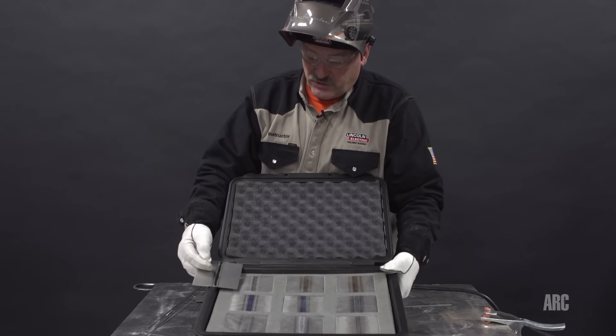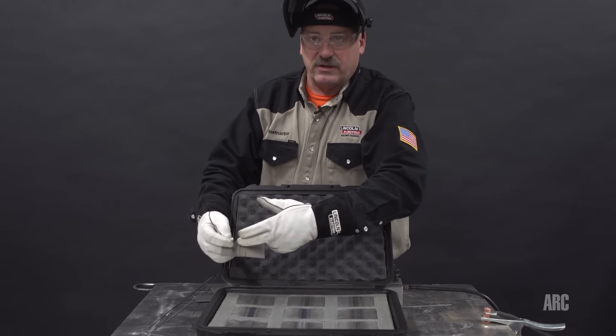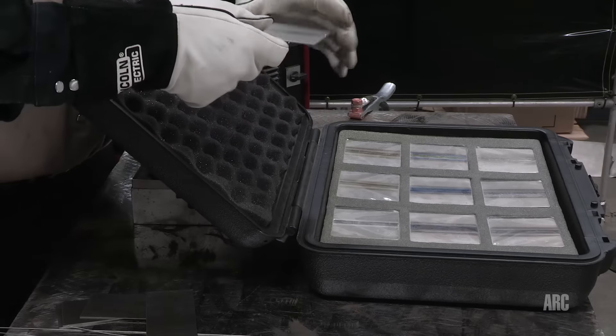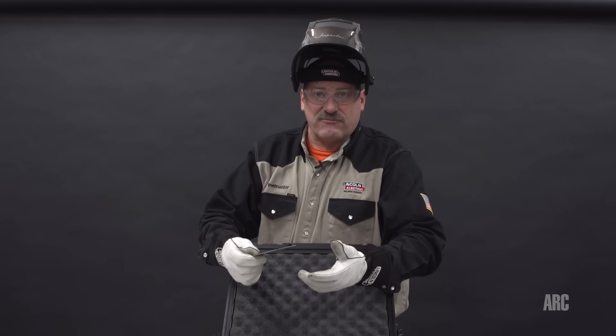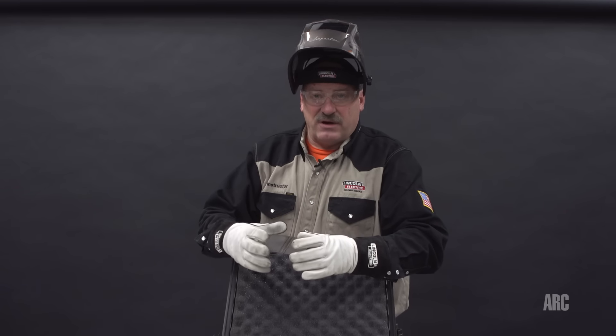As you can see, the color is pretty good here. If the titanium gets exposed to heat after welding by not using a trailing cup and there's discoloration, chances are it didn't hurt the weld that much as long as there was good shielding during the weld. But the inspector doesn't know how it got exposed, so if they see dark golds, blues, purples, or white, the part is rejected. Any structural component not purged on the inside — like a bicycle frame without argon inside — will severely embrittle the titanium. Any titanium heated above 800 degrees during welding should be protected from the air.